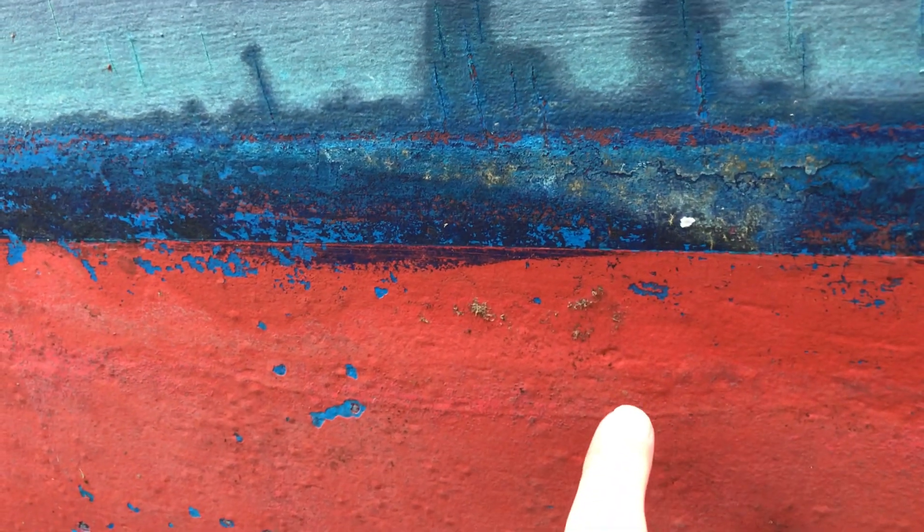So water has penetrated through the anti-fouling, penetrated through this outer layer, and is now penetrating the woven roving GRP laminate behind there, which we don't really want. That has the effect of causing a pressure increase behind this layer, which pops it out — and that's exactly what's happening with all these osmotic blisters. Water or chemical is pushing its way through here, causing the raised blobs or blisters as you can see them.